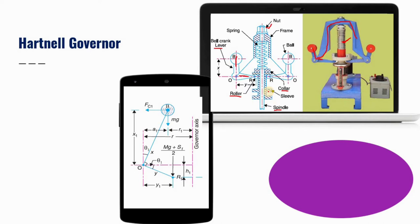This is the free body diagram of the Hartnell governor at minimum speed condition. Due to the centrifugal force, the ball arm goes outward, and with the help of the sleeve arm, it lifts the sleeve in the upward direction. Whenever the fuel supply valve closes, the equilibrium speed reduces, and the ball arm goes inward, so the sleeve arm also goes downward. This causes the sleeve to move downward, opening the fuel supply. The fuel opening increases the equilibrium speed again, the ball arm goes outward, and the sleeve goes upward. It is a cyclic process.